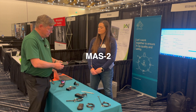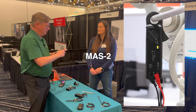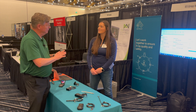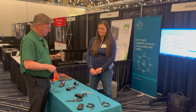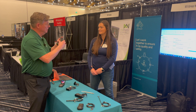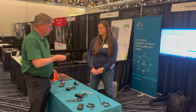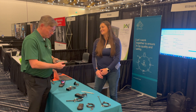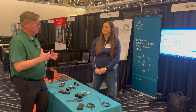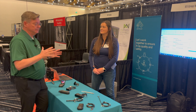What we also offer is a MAS II, which is a clamp-on. It actually clamps onto the high-tension cable by the tube. We connect the wire to the Piranha and put the Piranha in the beam. So in one exposure you just get the MA, mAs, KV, dose, total filtration, and HVL — all in one shot, superimposed. The most difficult thing is attaching it the right way. It's quite popular for troubleshooting for Biomed and for service staff for the first tests they do. You don't have to dig into the generator — just clamp it on. It's fast, easy, and safe.